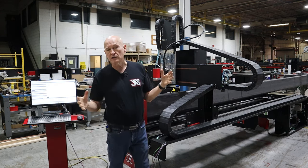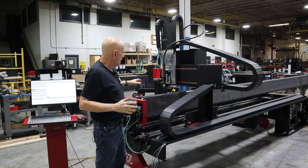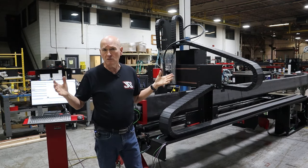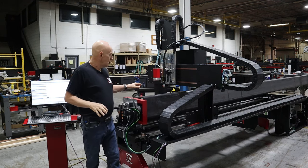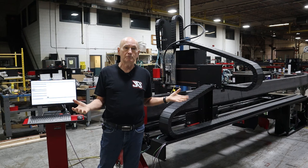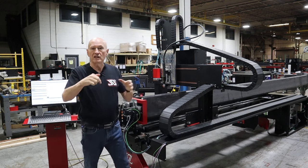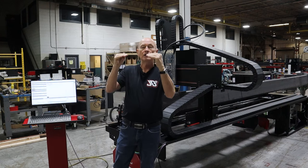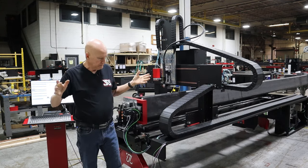The beauty of beamline machines is that you can load the I-beam flat — you don't have to spin it. Currently with the XR12, if we're cutting a 12-inch I-beam on three sides we have to put a ring on it and spin it, which is more work and time-consuming. So a beamline machine is more convenient for processing I-beams, channel, and structural material. We do load channel with flanges facing down and process the top when we're only doing one side.